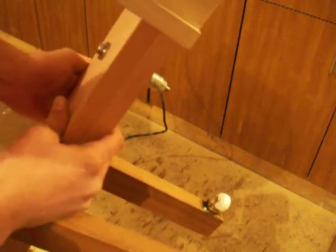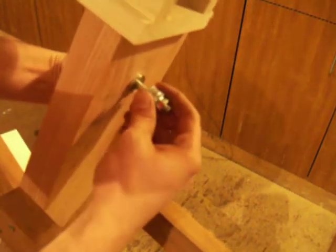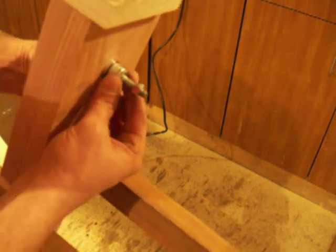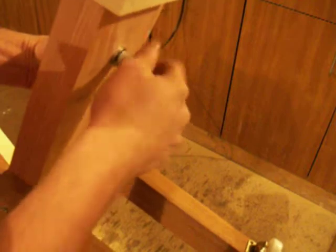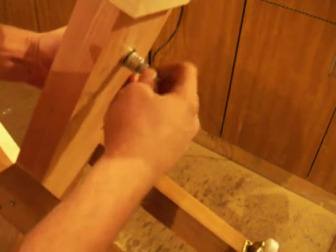I just want to make sure you understand this last part. What we've got here is a roller blade bearing with a bolt, another roller blade bearing on this side, then we took these washers and filled up almost all of the flat spot — just enough so when we screw this nut on and it gets tight when it runs out of threads, it can still flop around and spin.